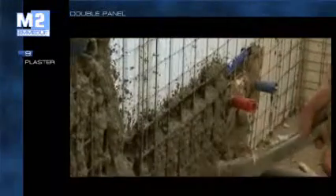The installation of shunt boxes for telephone or electrical systems, and the passing, fixing and housing of cables or pipes, are carried out rapidly. Internal and external rendering is the traditional finishing element. Normally there is a first coat to cover the mesh and a second hand coat for leveling and finishing. The various phases must be carried out using good quality material and respecting setting times.